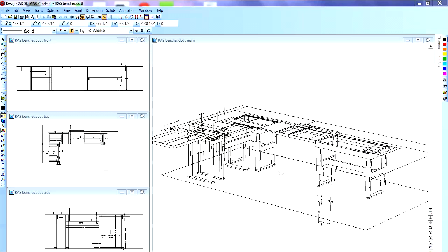In this design CAD rendering you can see the original saw tabletop, my existing shaper tabletop, and the extension tables. Here's where the compound miter saw will go. The height of these tables is 35 inches; the height of the shaper table is 37 inches, so I can do shaping without interference from the table itself.